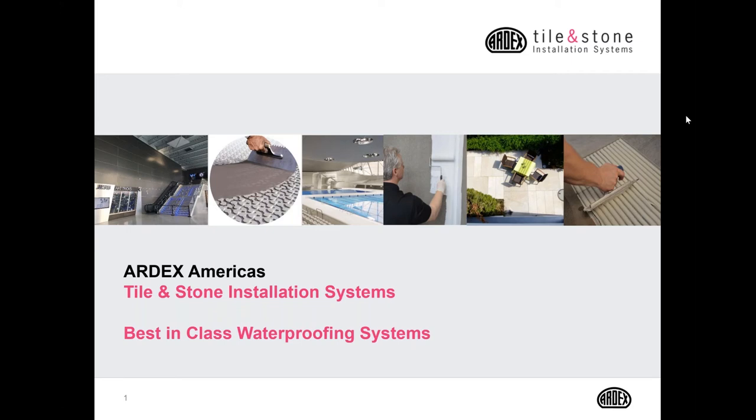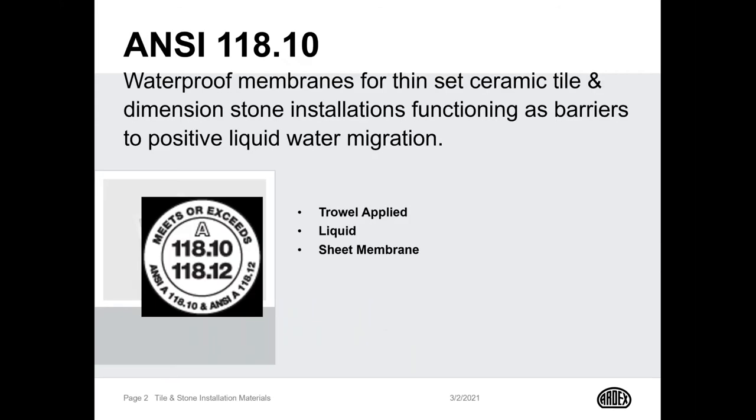Great, thanks, William. As William said, in today's webinar we will be covering bonded waterproof membranes. We'll take a look at the options available and also the accessories needed while waterproofing. ANSI 118.10 is the designation for a bonded waterproof membrane. It's for thin set ceramic tile and dimensional stone installations that are functioning as barriers to positive liquid water migration, meaning from the top down.